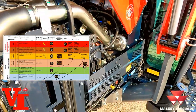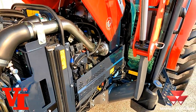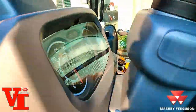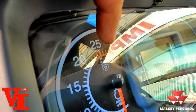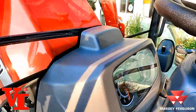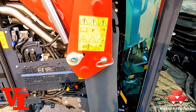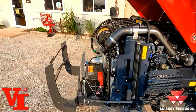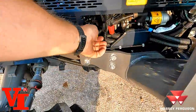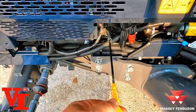This does have the diesel particulate filter, but as we've explained, this is an automatic regen system. All you've got to do is when the light starts flashing, keep on going — just raise your engine RPMs up into the orange band, which is about 2,300 to 2,700 RPM range. Run it up and it's going to do the regeneration automatically. The light will go solid and then go out when it's done. Very simple and easy. I would not worry about it — it's about a 50-hour average.